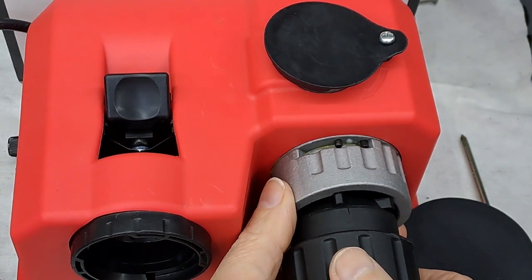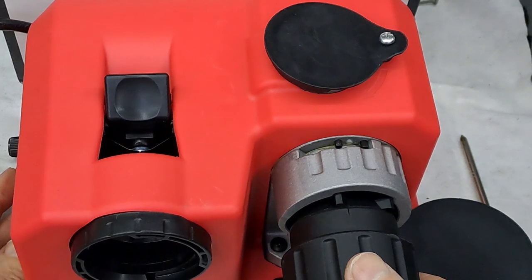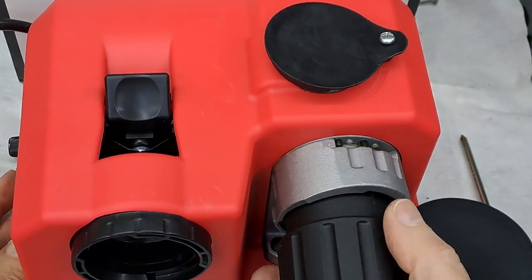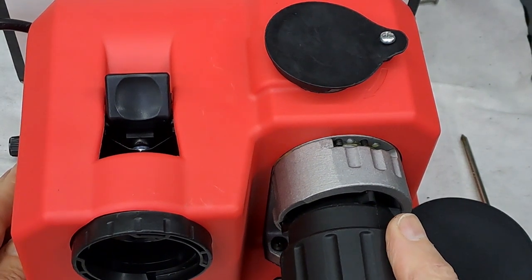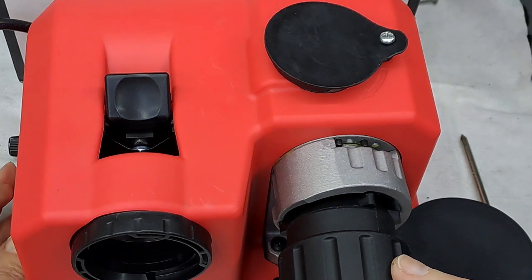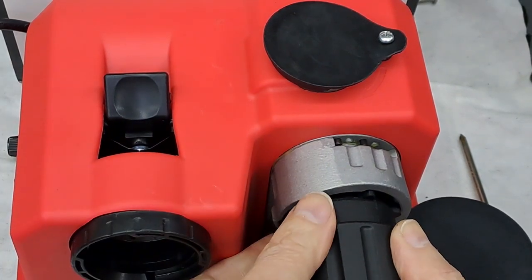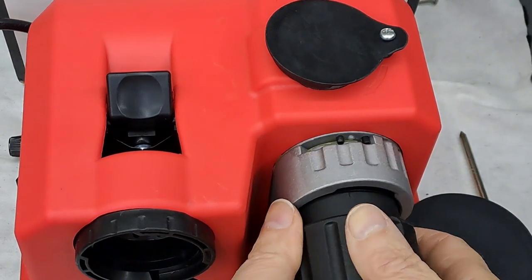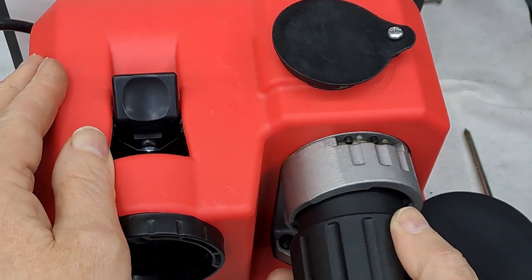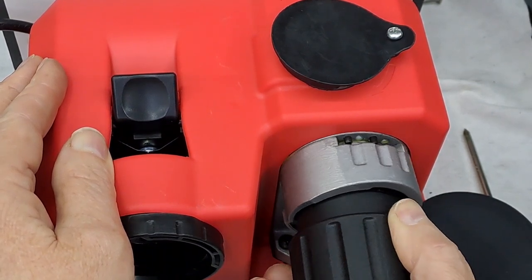What I've found — I've already tried grinding a few — so you don't really want to be jamming this thing in, because it hits the grinding wheel fairly hard. What I've started doing is getting the machine running and going in gently so you hear it grinding. The system is: when it stops the grinding noise, take it out, whip it over 180 degrees, grind the other side — repeat until you get as little noise as possible. Going in gently, gently, until we make contact — there we go — back and forth.